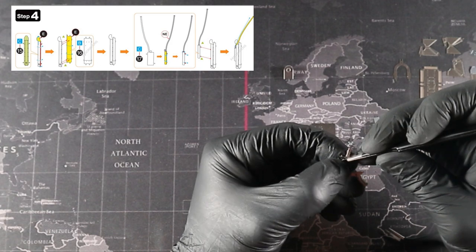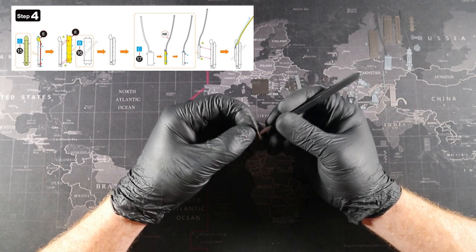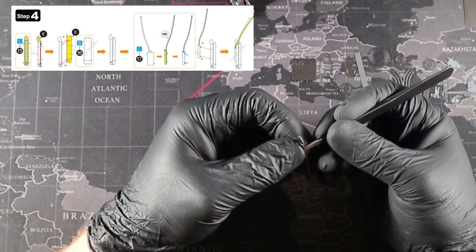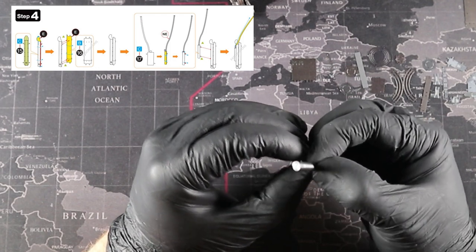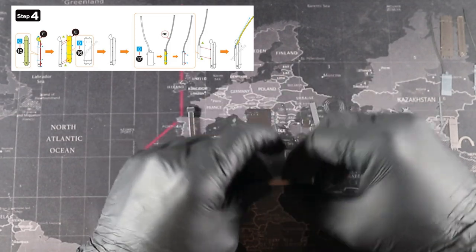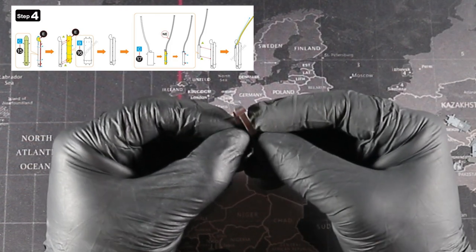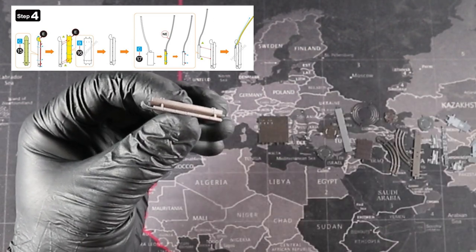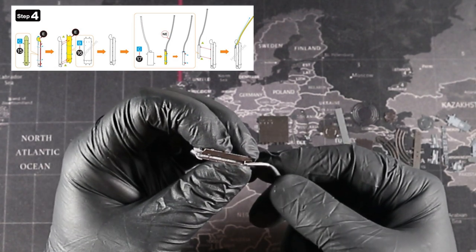Next, let's look at parts 15 and 16. Normally when adding details onto parts, it's best to put the details on the main part first and then form it. In this case, parts like 15 and 16 need to be shaped first before they can fit properly together. Cylinders are best bent using a bigger tool first, then working your way down to the right size — this avoids different kinds of creases forming in the metal. Part 16 needs to be shaped into half a cylinder. If your tabs are stretching to get into place, you may need to make it a little smaller. If the tabs are over the holes, you may have over-formed the piece. Bringing these pieces together a few times before connecting them is a great way to ensure a proper fit.